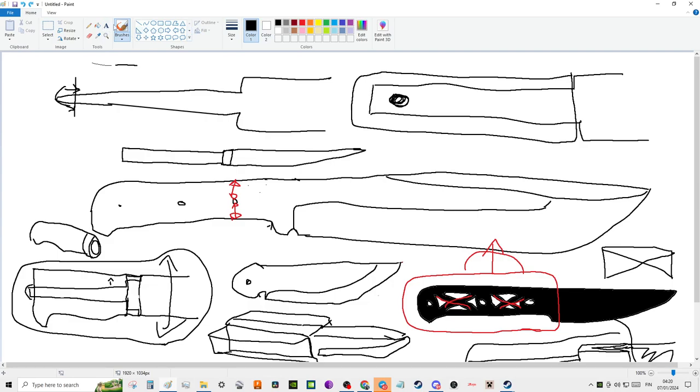what really is the main thing you've got to be looking for, of course, is, oh, it's already painted, right? It's how thick is this? And how thick is this, minus the pinhole, right? Because often you will see massive blades like this, and this top distance plus this bottom distance, those two combined, so the full width of the tang minus the pinhole, will often be actually smaller than even a relatively small rat tail at the front in that location, which is where the majority of your forces are going to be. So there's a lot of things to consider, of course.